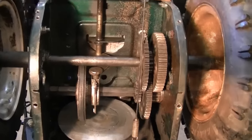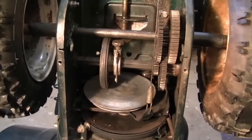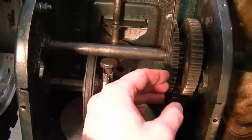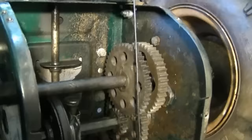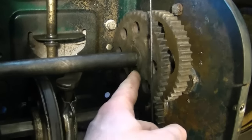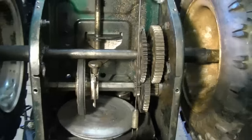This is the system I'm talking about — all these gears. Maybe some of you have had your blower open and saw these. What happens is these get worn out, especially if they don't get lubed every year. There are needle bearings in some of the gears, and with the gear being loose, it forces the e-clip out of its socket, then the gear comes out and your drive won't work anymore.